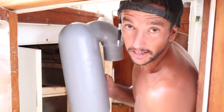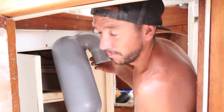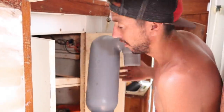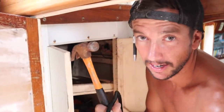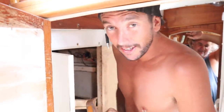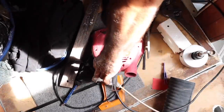We need to find a place for the gooseneck — this needs to be as high above water level as possible, and basically it's going to be up underneath here in the man cave. We're going to mount it up in here and then run the outlet down and drill a new hole in Nanji for the exhaust outlet. There are two types of people that own boats: the people that are afraid to drill holes and the people that ain't. There are also two other types: people that hire people to do stuff, and others that just GSD.